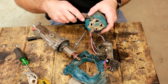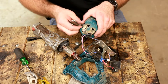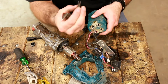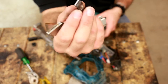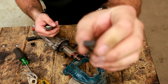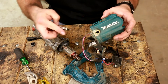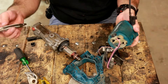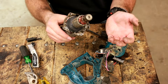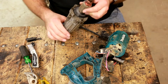In the back there are brushes — these are the brush caps. It's a standard carbon-type brush. The brush goes in here, the other brush goes in there. It is a brush motor. The brush rides along there, switching which coil of the motor is activated at any given time. If you want to learn more about that, Google brushed motors — I'm sure there's a Wikipedia page.